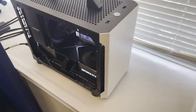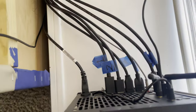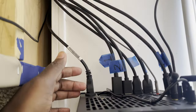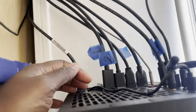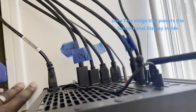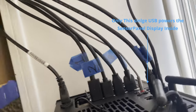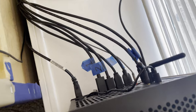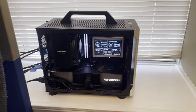So quick overview of the PC there. On the back, as you can see, the power cable there, all the display ports, just four display ports. And once we get inside, I'll explain a little bit of how I'm able to power more than four display devices, but just four ports and then two data cables here. Two USB 3.0 cables going to 16-port powered USB hubs, and that's where everything is connected to. So that's a quick overview of the PC that powers the entire flight simulator.